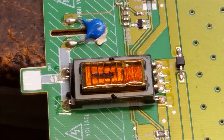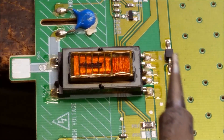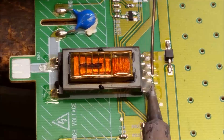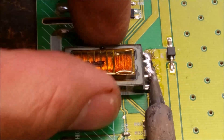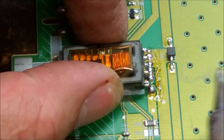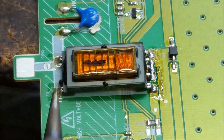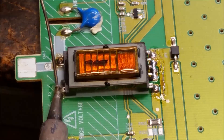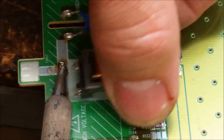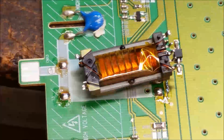I've got the transformer — I just put a little mark on it so I'd know which one is the good one and which one's not. All I'm going to do is add some solder to all these pins to get them all molten simultaneously. I realize there's going to be a little bit of a bridge, but once I get the end of it lifted up, I'm not really going to care too much about it. Because once I get it free, it won't actually matter. Do the same thing to the other side here. So there I've got my transformer completely off of the board.